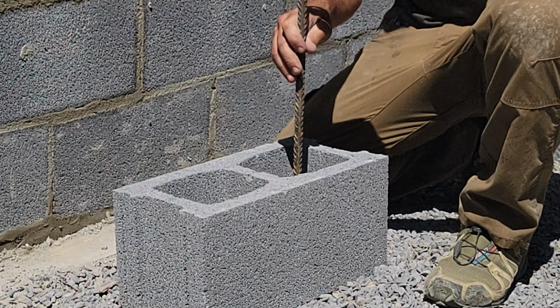The other thing we're putting in the wall is Durawall. This is horizontal support. This webbing goes in every 2 courses in between the block. So as you go up 2 courses of block, you lay this webbing down. You put your mortar on, and the block goes over it, so that gets sandwiched in the horizontal coursing. So when this next course goes on, this is sandwiched in the middle, the rebar is coming up here, so this gets filled solid.